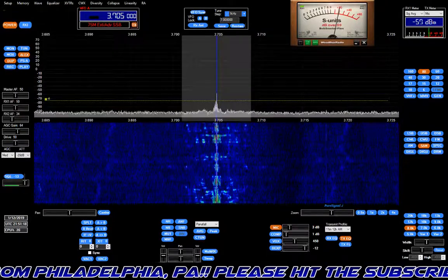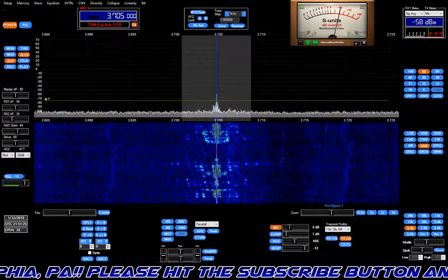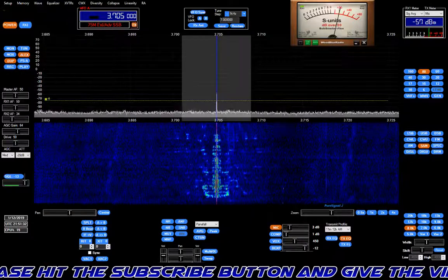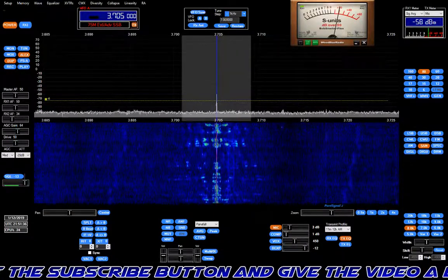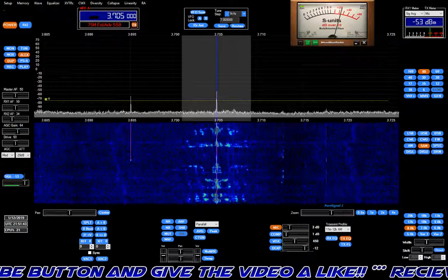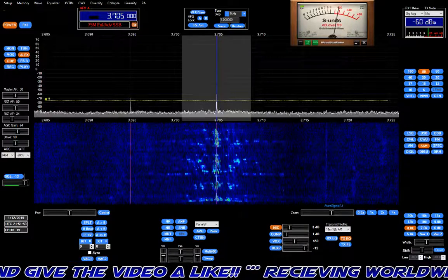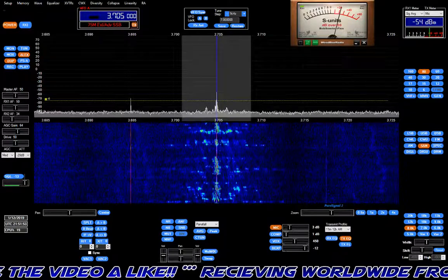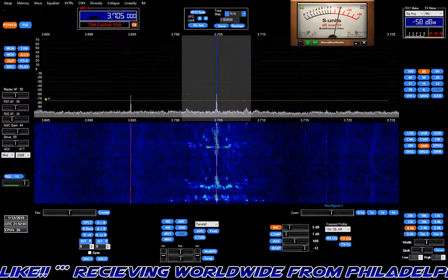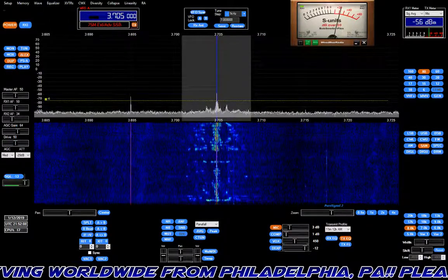And it's been morphed a few times. The original modulators were 806s. But one of the filaments burned out and I wasn't able to find a replacement for it. Those are really scarce tubes, 806s. They were like 250 watt plate dissipation triodes, similar to 250THs, but the impedance was a bit different. So I had a higher impedance mod transformer on that than what I wound up with for this 833 thing. But I rebuilt the modulator into the 833 later on.